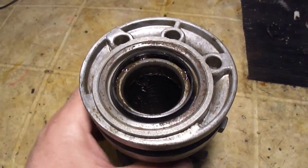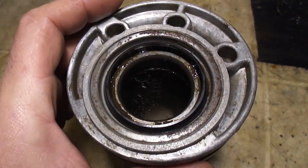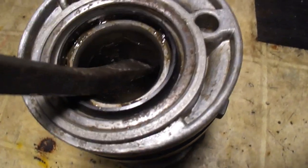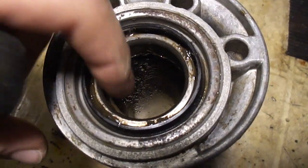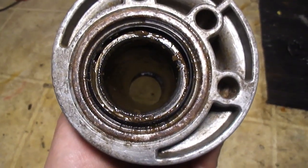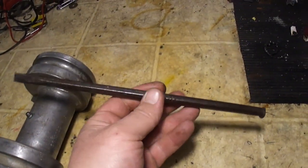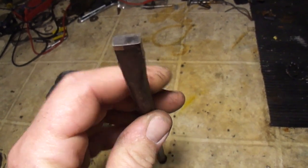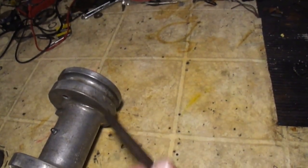The reason why we're all here is to get these bearings out. There's a sleeve that runs through the center in between those bearings and there's no lip to catch the bearing on. So you've got to pry this thing over — there's probably going to be a lot of grease in here — so you've got to pry it kind of hard. You can see how it's kind of shifted over. If you look down the inside, you can just catch the inside of that inner race on the far bearing. You're going to need something long — I'm going to use this chisel. You can use a drift or a punch, but you want to make sure it's got nice square edges on it, otherwise you'll never get that bearing out.